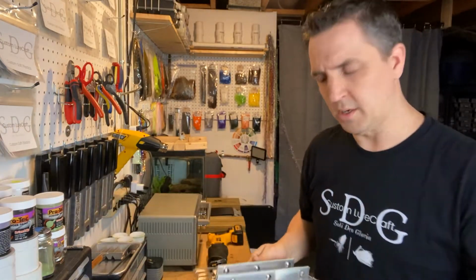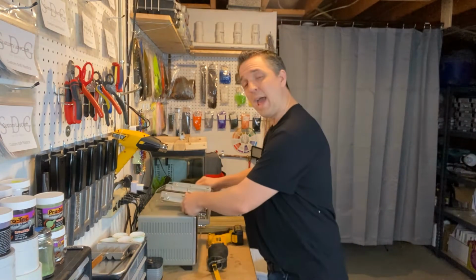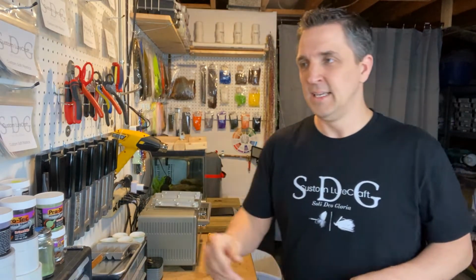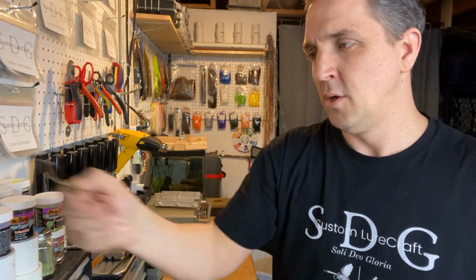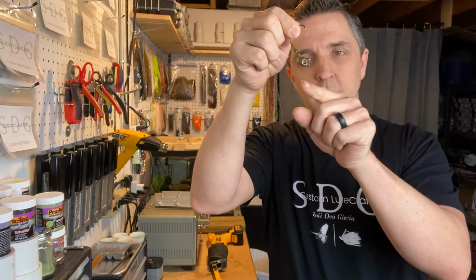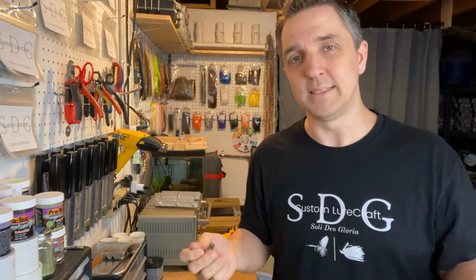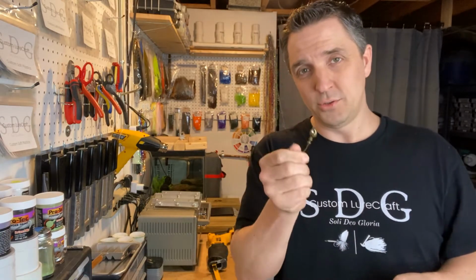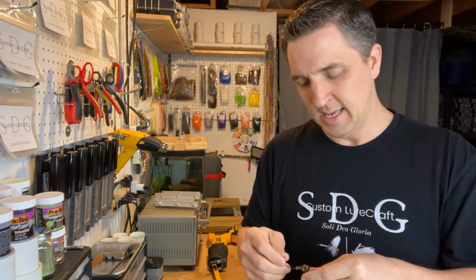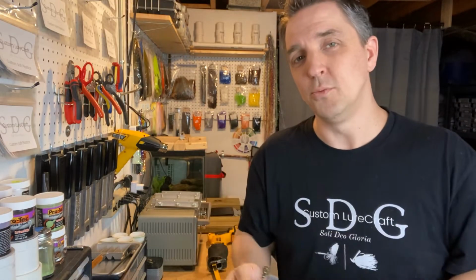One, even if you're using a powder, or even if you're using a fluid bed, there's times when we get too much paint on the jig head. And what happens when that takes place is that thicker paint will find its lowest point, and it'll droop all the way down and sag, and you'll get a bump right here on the bottom. And maybe that's okay with you. I obviously sell lures, and that's an imperfection that I'm not going to pass on to a customer. So I need a solution that safeguards myself, unless I'm absolutely sure, and I'll go ahead and hang them. But every now and then we make mistakes, and we get a little bit too much paint on there, and it causes it to droop and sag.